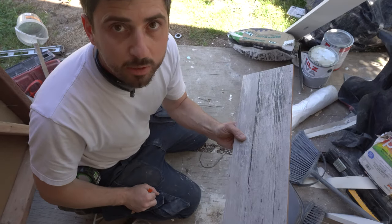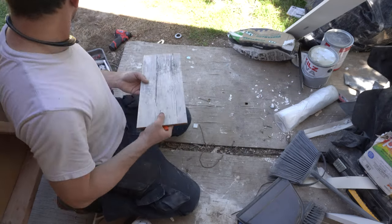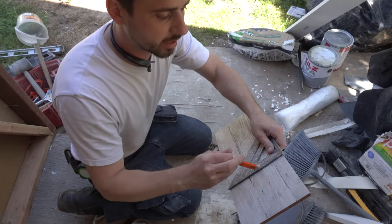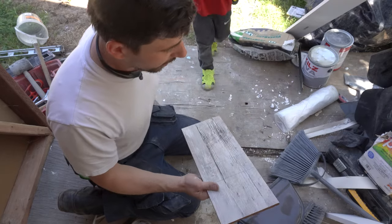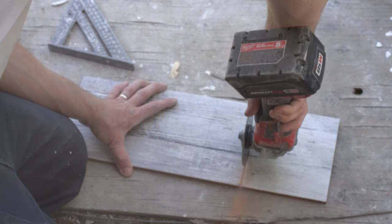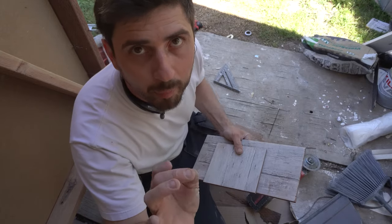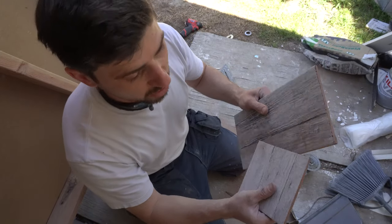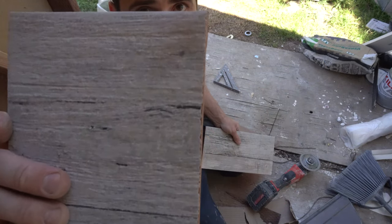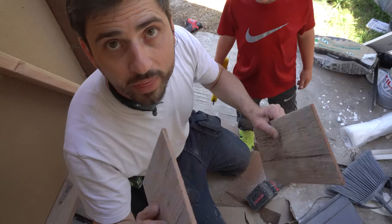The next thing is I need to make a cut using an angle grinder. Basically I'm going to make a line — if you have a speed square, use it, I love a speed square. We make the line and then start making the cut with the angle grinder. These cuts aren't the most beautiful but they're nice and perfectly straight. You see the chips on it — I'll show you a trick how to cut with an angle grinder without chips.